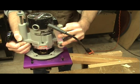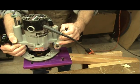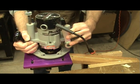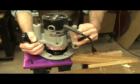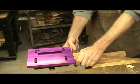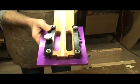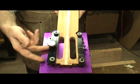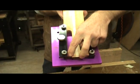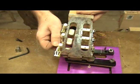Now with the jig and neck clamped in your vise, use your router to remove the material where the rollers go. Remember to take small bites, plunging a little more after each pass. When finished, remove the jig from the vise. You now have drilled the tuner holes and cut out the slots in one simple, quick, and precise operation. It doesn't get much better than that. After removing the neck from the jig, insert the tuners and admire your work.